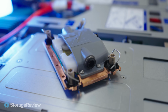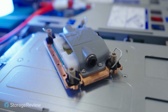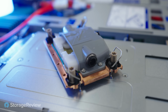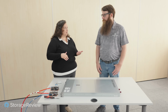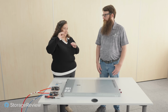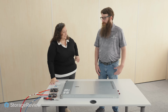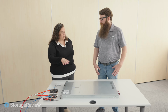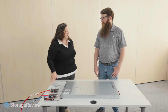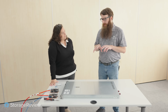Once some liquid evaporates or boils, vapor goes out, the liquid level goes down, the float goes down as well, and then more liquid goes in. So this is a completely mechanical way of monitoring the amount of liquid that goes inside in order to keep the pool just enough high inside the evaporator. So each CPU or GPU in the entire system is self-moderating its flow? Correct. It doesn't matter what its location is inside the server or inside a rack.